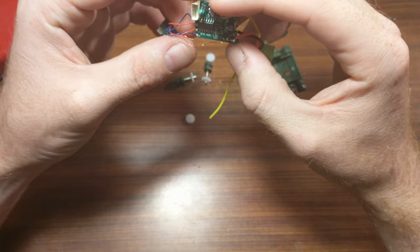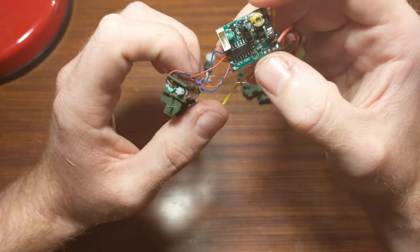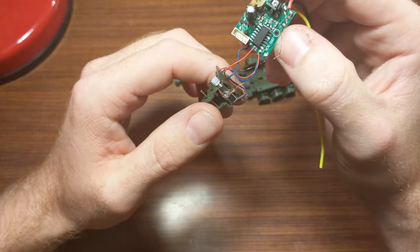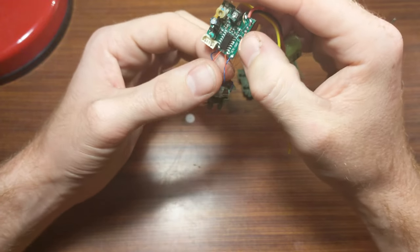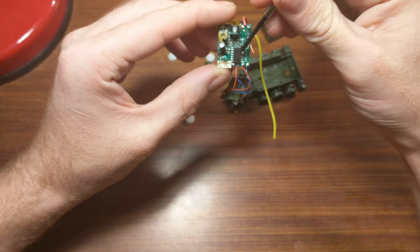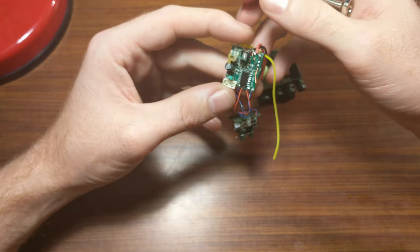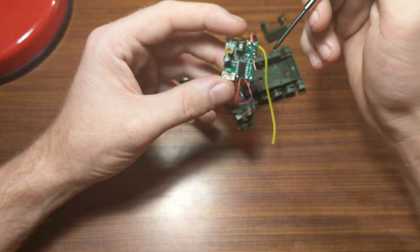Following where the magnet wire goes — they both go to ground. That could just be to reduce EMF, but that really sounds like a cop-out. I don't understand why you need to ground the cases of the motors, because you already have two wires and there'd be an H-bridge on this chip for driving the motors forward and backwards. I don't understand why the motor case has to be grounded unless it's for some strange noise reason. If you know why, throw it down in the comments.